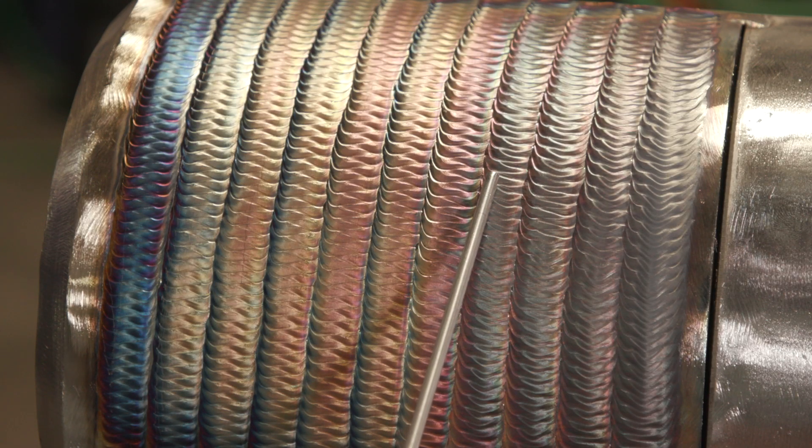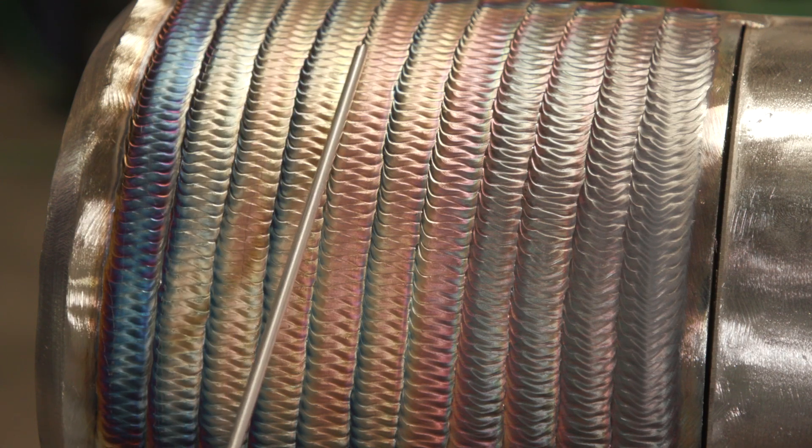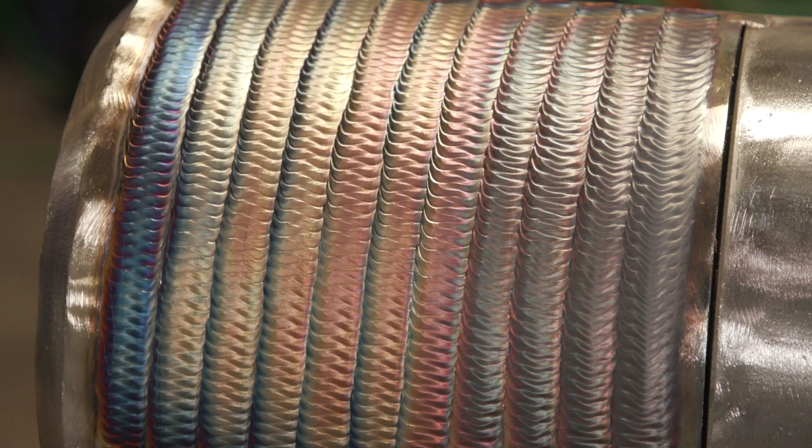After that reddish color, it's going to give you this faded purple grayish color — and that's letting you know you're at the point where you're about to overcook the metal. If you keep going, the weld just starts getting grayer and uglier. This is the purpose I wanted to demonstrate: it starts from a purplish color, you see some blue in there, then some gold, then some reddish around this area, and after that reddish color — bam — you get that overcooked ugly gray color which you don't want.